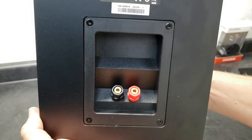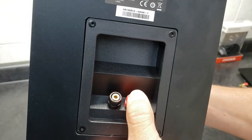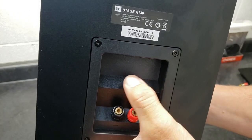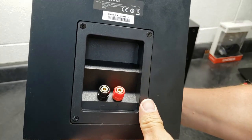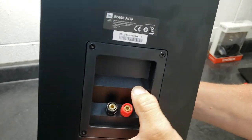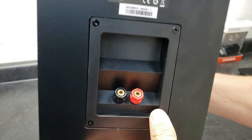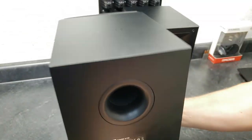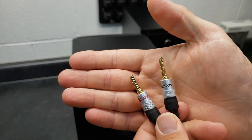There's your standard terminal cup — you can tell they use this cup in other products because it's actually a bi-wire bi-amp terminal cup, it just doesn't have the extra binding posts. It's not hurting anything, but when I first saw it I thought, that's a large termination cup for only one set. Let me grab some speaker wires with some full-length banana plugs — these are BFA-style banana plugs, and better banana plugs are generally all roughly the same length.